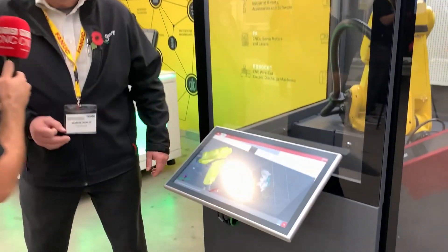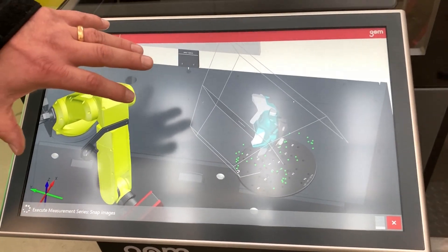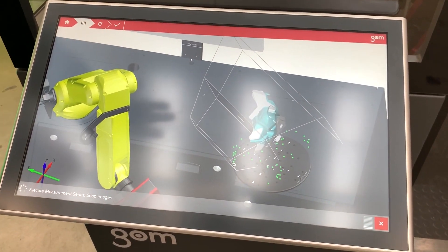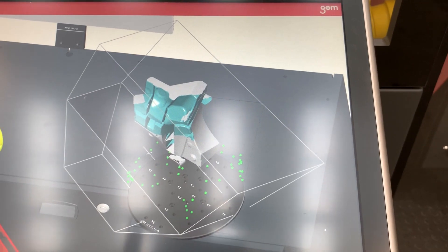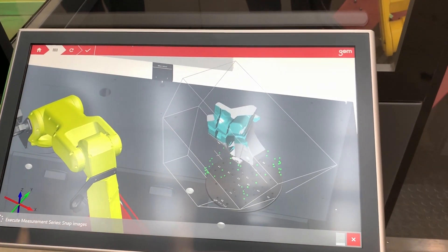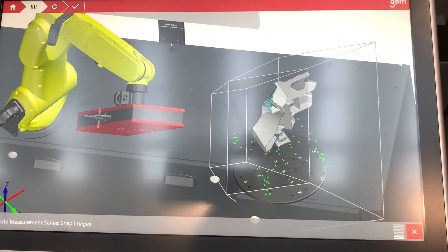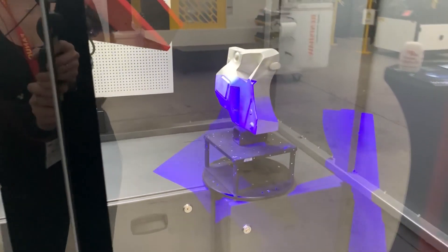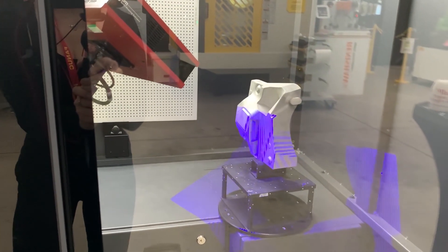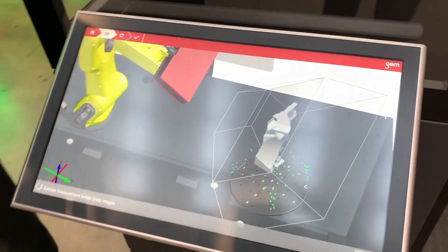It's creating a point cloud here — can you explain how this works? What you have on the screen looks, for all intents and purposes, to be a solid model, but it's really not. This is a digital definition made up of millions of point clouds to give that full 3D representation of the part. With a conventional CMM you're only picking out maybe 100 points of inspection — you don't really know what's happening in between. The beauty of the full 3D definition is you can bring in the nominal information and very quickly see exactly where the differences to nominal are. This is generally portrayed as a colour plot, so it's very easy and visual to see, or you can export it as specific geometries if that's what you demand from the system.